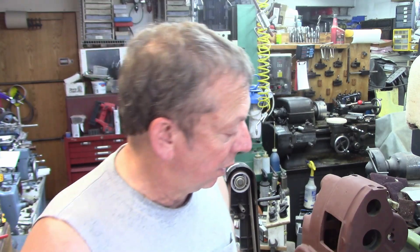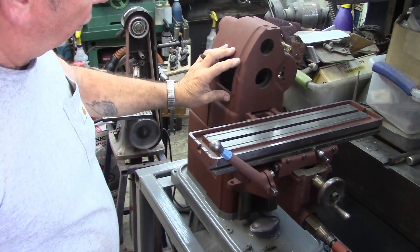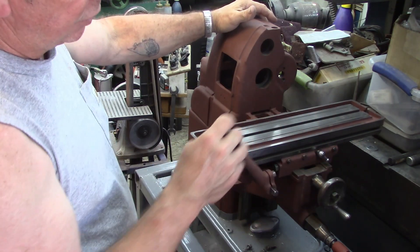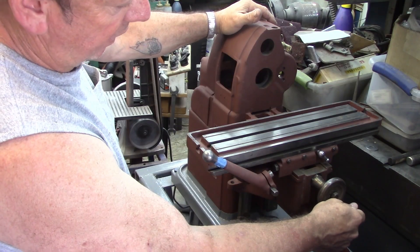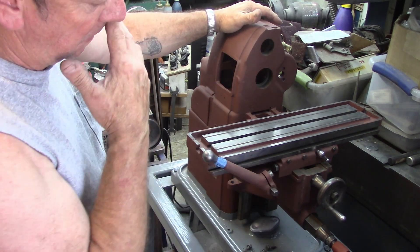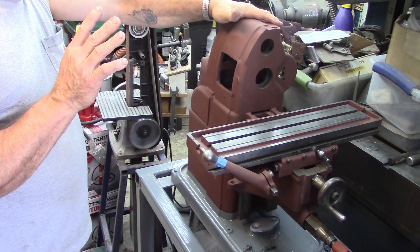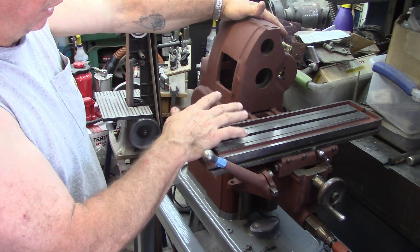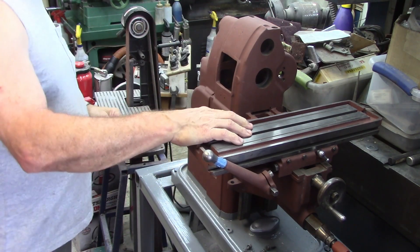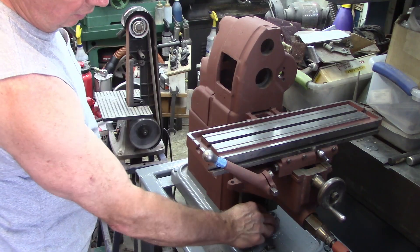Let me bring you down here so you can see the machine. Everything is just kind of locked in place. The next pattern making will probably be the door that goes on the front. I've got to build the depth stop that goes here. The table is in place, though there's no cross feed nut. The knee will raise and lower no problem - I don't have shims in it so it's tightened down and locked. I still lack the countershaft assembly, motor mount, and basically all the castings that go on the back.